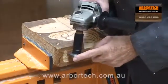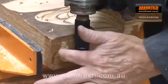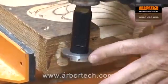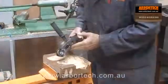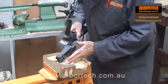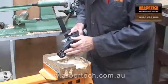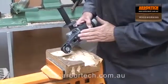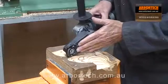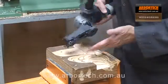So that's how the blade should be cutting, and you can see that's why it won't grab or pull, because it rides on this surface, it can't cut, and that acts as a guide and prevents it from biting. Now on the mini grinder, if you want to do slotting and cutting on that angle, you really are better off using one of either the mini industrial blade or the blades that come with the mini grinder. But if you want to do more smooth shaping, etc., particularly flat cutting, this blade is the blade for you,